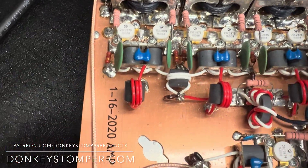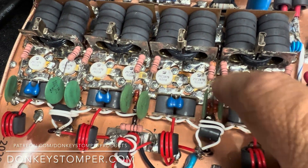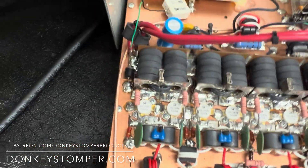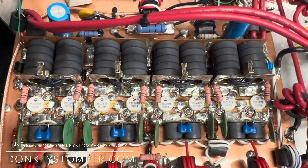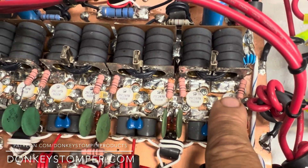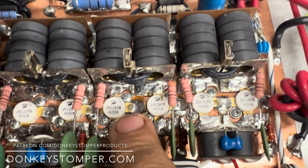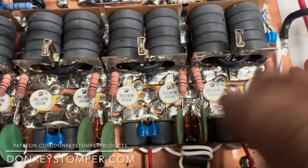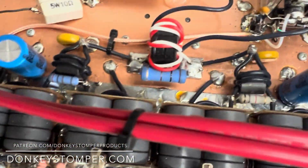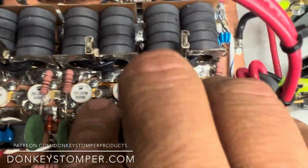I'll go ahead and check these — maybe 104 caps, I'm not sure. I'll have to look at them; if they aren't the right caps I'll change them. We know we've got one pill down in here — or two, but probably just one, because that resistor has been hot. Normally I'd just pull the one bad transistor out and fix it, but these resistors aren't blowing because they're not the right kind. I can't see any black on them so I can't tell which one it is, so I'm going to pull all four out and test them.